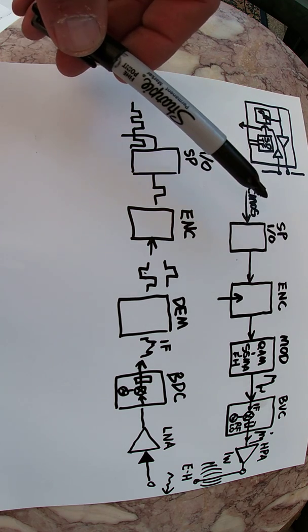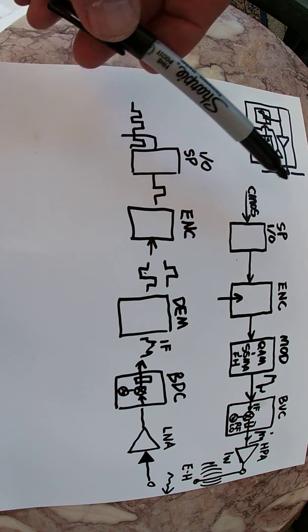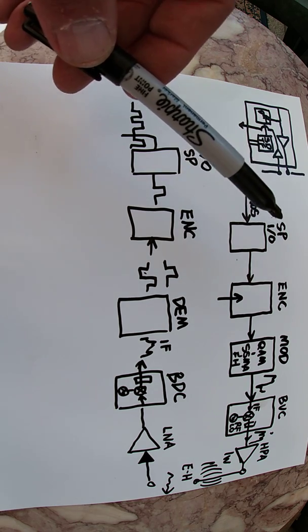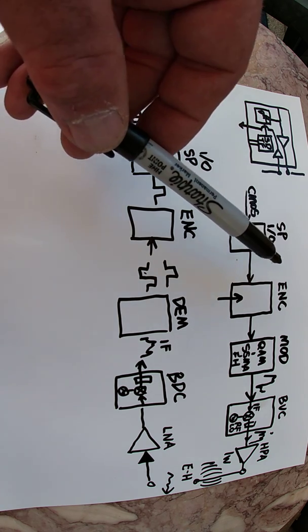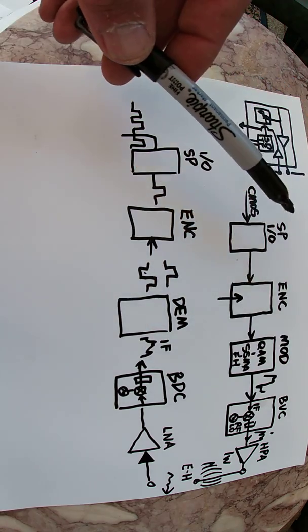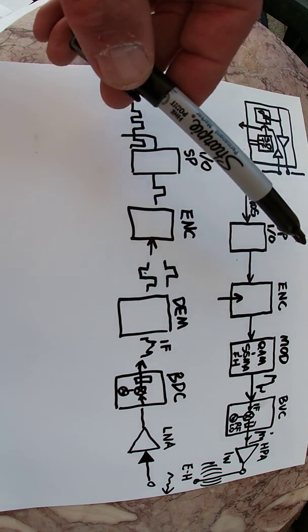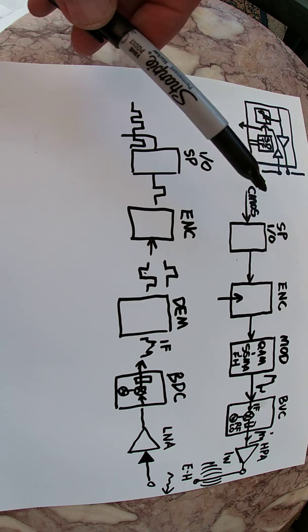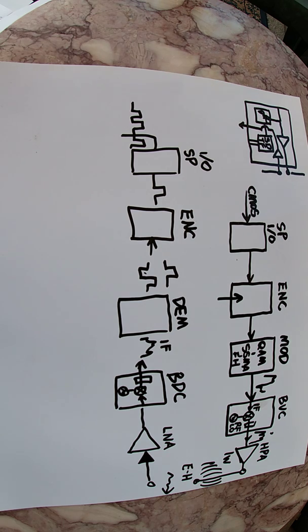The only difference here for the analog FPV guys is that instead of the CMOS, they'd take CCD analog video coming in, basically coded NTSC and PAL. It's not pure analog, it's got frames in it. But they'd need an A to D converter to convert that into digital data and then encode it and then modulate it. So they've got an extra phase, and that's the extra amount of delay, just encoding that, processing it, sending it over. It's down in the nanoseconds or something, but every nanosecond adds up. So anyhow, this is any kind of two-way radio system in a drone.